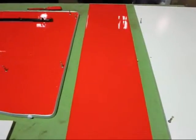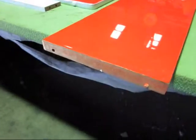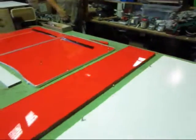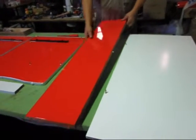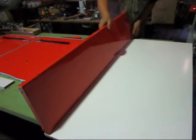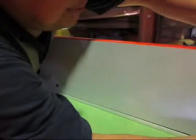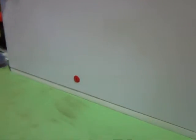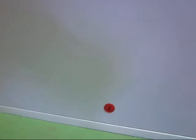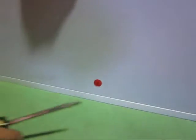Next we join with these red pieces. Now this piece is item number 7. With this piece here we're putting one wooden dowel there at the edge, one in the middle, and also one on the other side as well. Now we're going to join this red piece and the white piece together in this manner — like so. Make sure it's nicely tight fit, and then we put in two locking devices — one there, and also one on the other side. Now bear in mind when we put in a locking device, make sure the arrow is facing the hole in the direction of the screw, like there. And then when it's actually nice and tight, we turn it in a clockwise position to secure it in, and also on this side as well.